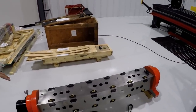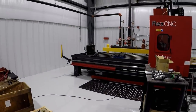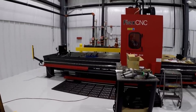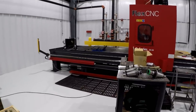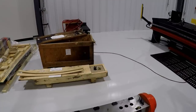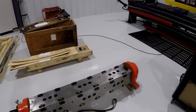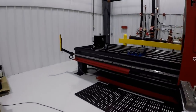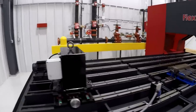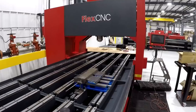Wow. So the machine that these guys have, they run dual fourth axis on the machine. You've got one at the left side, one at the right side, and they're running that pendulum mode side to side. Once the job's done on zone A, they're going to move down to B. So 1, 2, 3, 4. So they're running what, 16 parts per side? Correct. That is cool. I just think that's crazy capabilities, man.